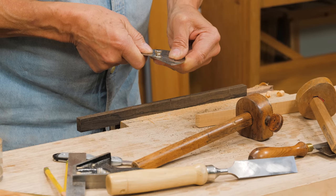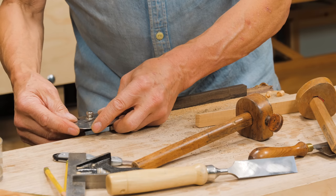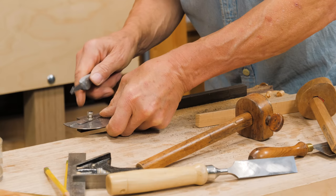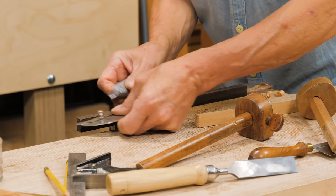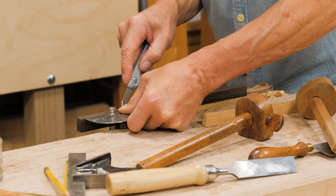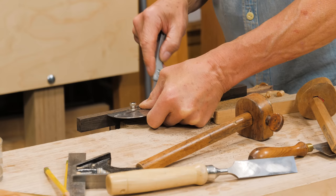I'm right on that gauge line; I still have another gauge line — I'm going to do the same on this other one now. I've got to reverse this all the way around to 18 degrees on the opposite side. How important is this 18 degrees? I think it is important. So I go to that cross-grain point again, go right on to the kerf — on the very corner of the kerf — and make a pull with my knife. This wood is so different than that cherry. Sometimes you come across woods and then you wonder why it was in your rack for 5 or 10 years, and then you remember why.